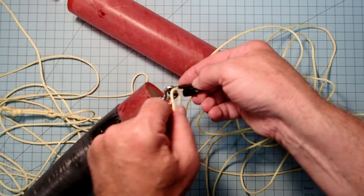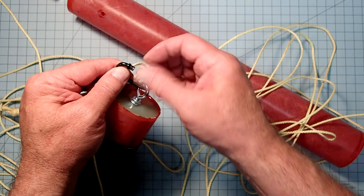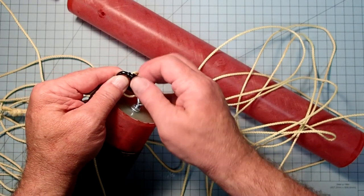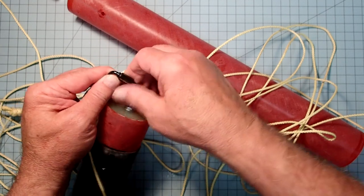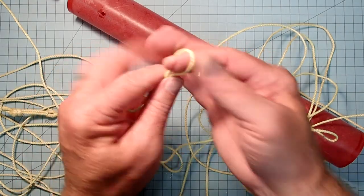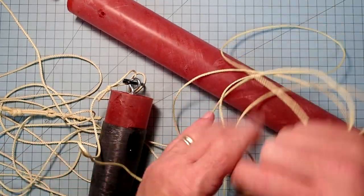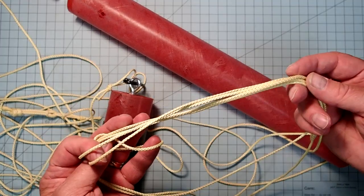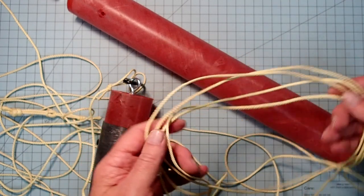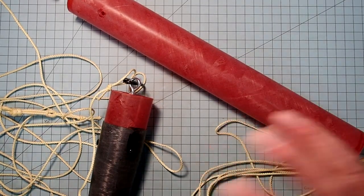Right, and that'll hook on there and the shock cord there. And similarly, for your main parachute, if you're doing this dual deployment, you can either hook it on to the quick link or you can hook it on to a loop in your shock cord. And again, just like with the main body tube shock cord, you can use tubular nylon. You could use a heavier Kevlar if you really want over redundancy there. Okay, but that's how all the things tie together.